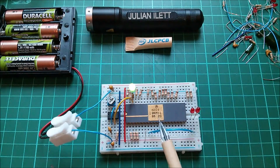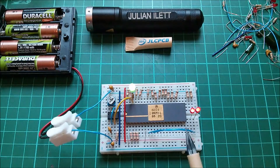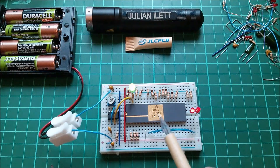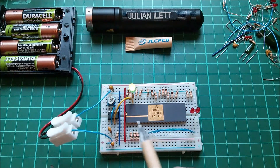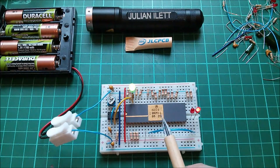Let's have a look at what's on this breadboard. We have a Motorola 6809 microprocessor, 40 pins. This is one of these rather nice ceramic chips with the little metal lid covering the aperture where the actual chip itself is sitting. This will be soldered on - it's probably even gold plated. The pins almost certainly are gold plated. And it says BN mil on the top, so is that something to do with military spec?